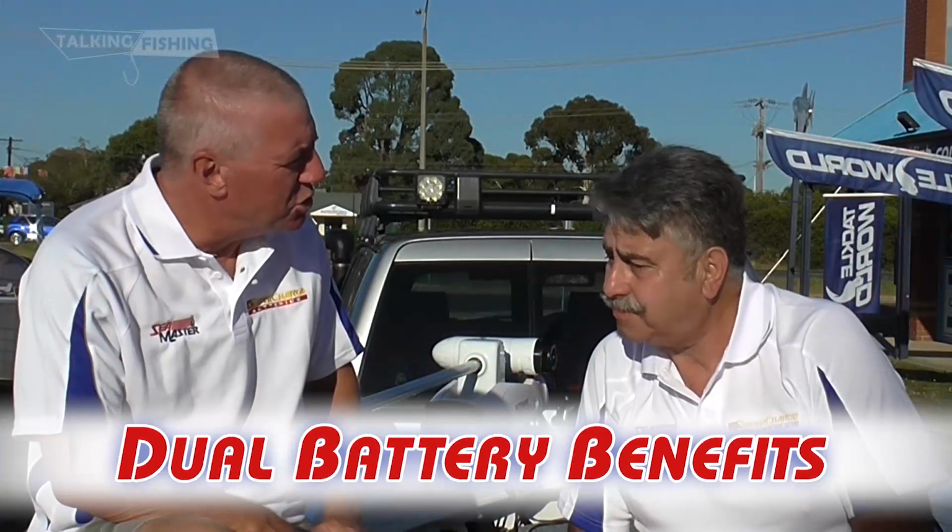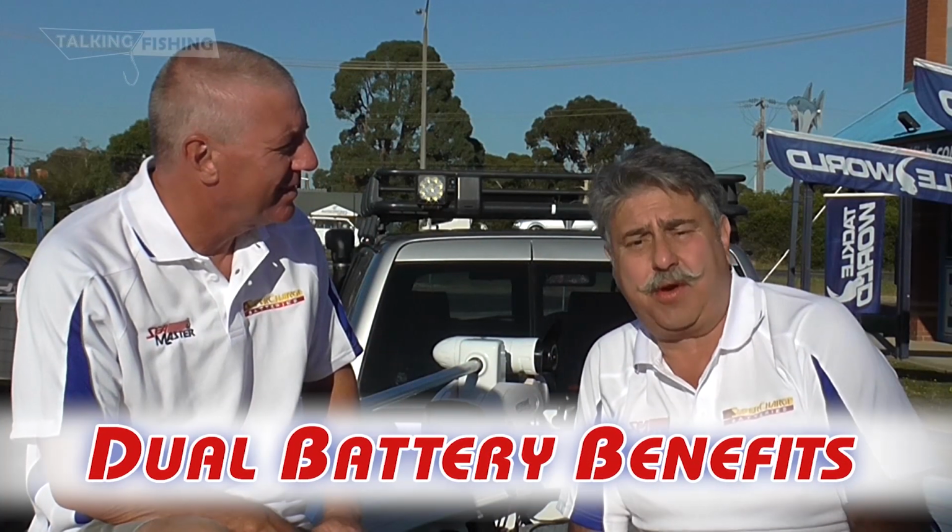What's the benefits of having dual batteries? Great question. We get asked this all the time, Dave. Basically, it's a safety issue, in my opinion. When you've got a dual battery system, it allows you to have one battery wholly and solely to crank your engine. So when you're out in the bay, that's all it does. It'll get you out and get you in. The secondary battery is a deep cycle, and you've got everything else associated with accessories running off that. So you're never draining off the main battery.